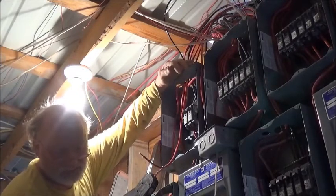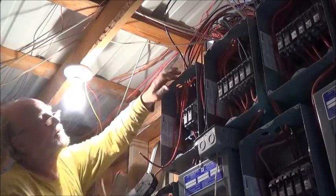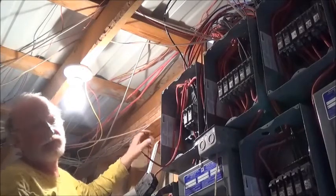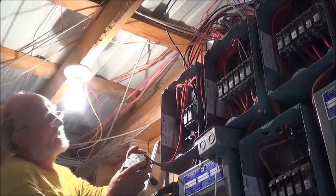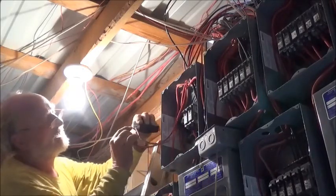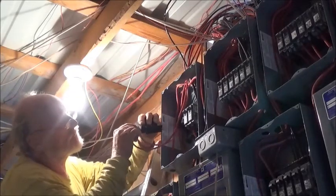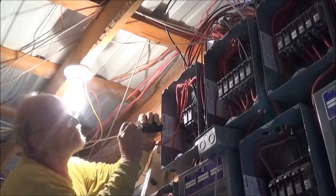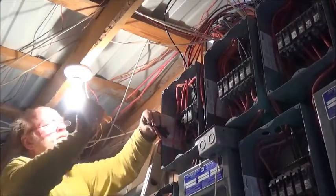The amp meter — which in this case is defective and I sent it back — and then down into my bus bar. So we've hooked up the negative. The negative goes to what would be the neutral line if this were a regular electrical system — the white wire. Now we're putting red and black so there's no confusion. We put the red wire into the circuit itself.